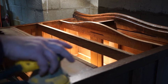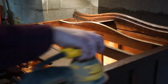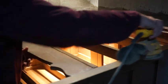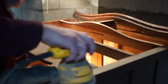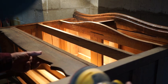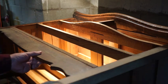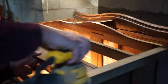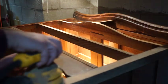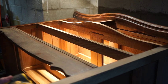So I took down this front detail at the bottom of the dresser when it's standing on its legs, as well as the legs, and then cleaned up the sides with a light grit sandpaper. And eventually the combination of multiple stains that I used on this dresser is beautiful. Some nice photographs at the end of the video. The payoff, if you're still hanging in there, is very high on this one. It's a beautiful piece of furniture.